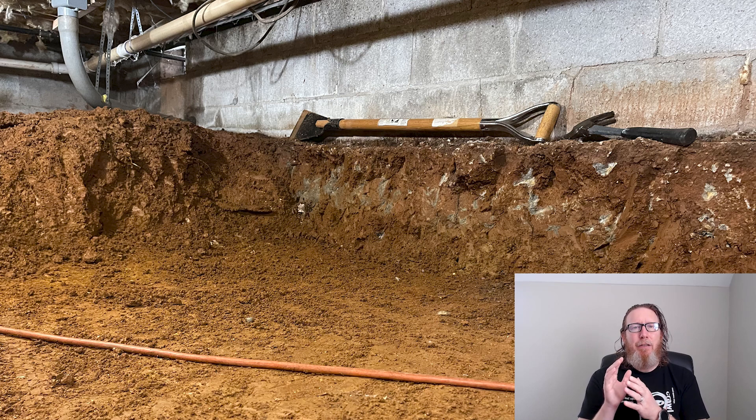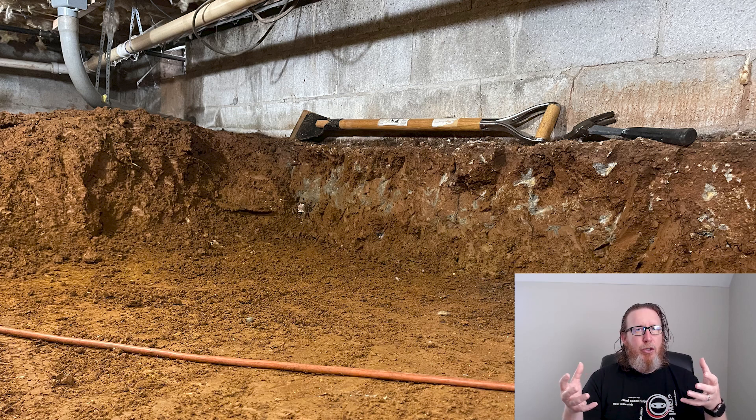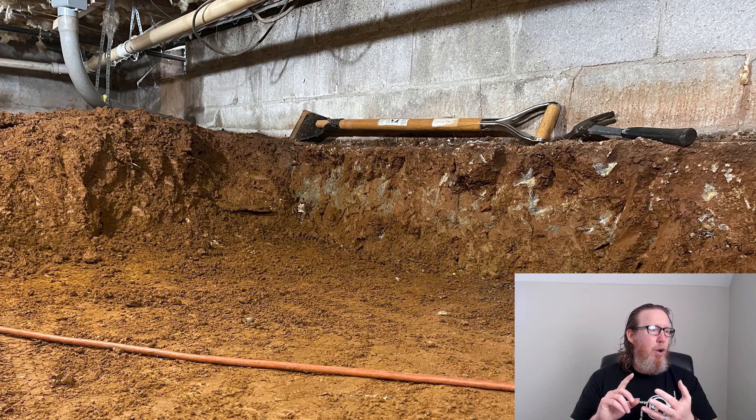Keep in mind that a footer system is designed to rest against soil on both sides, plus have soil still supporting it. Even with soil surrounding a footer system on all sides, the footer can still shift — it can move and shift. There are a lot of foundation repair companies out there. We do foundation repair with helical piles and push piers to lend support, especially in a place like Texas. They have some soils that tend to move a little bit easier, like you would have in Delaware, on the coast where you've got a lot of sand and silt. Even clay soils can shift and move.